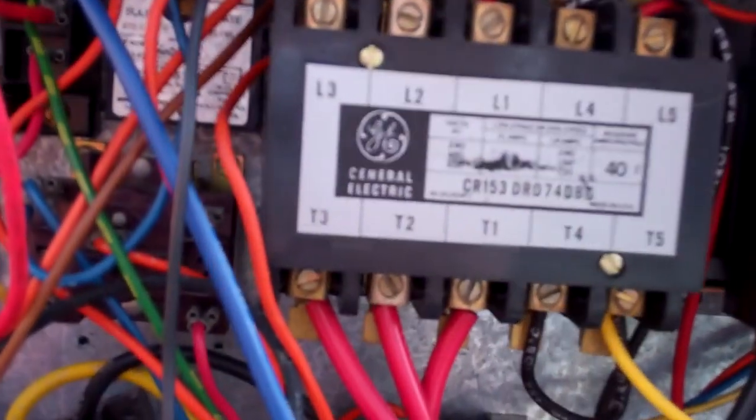I've been looking at this for longer than it should have taken. I think the problem might be with that compressor interlock there. As far as I can tell, the power for one side of it goes to the contactor coil — either one of them, high or low speed coils. And then the other side of it comes down to this eight-pin relay on this orange wire.